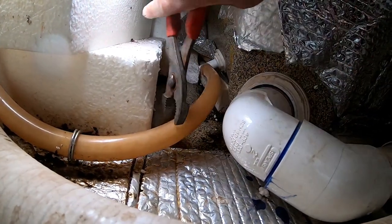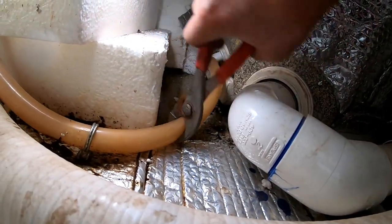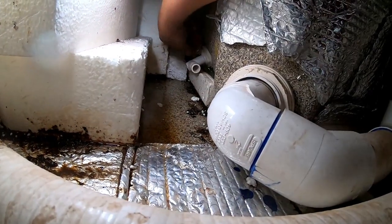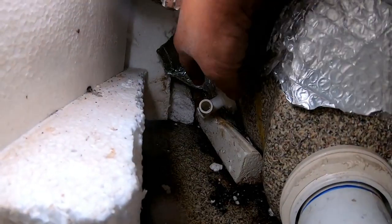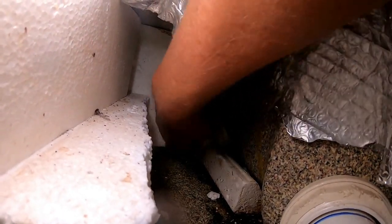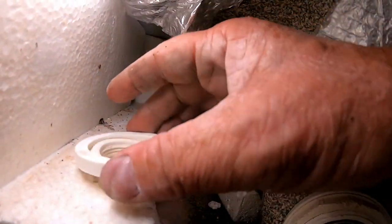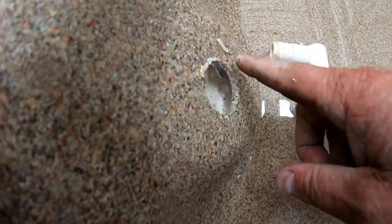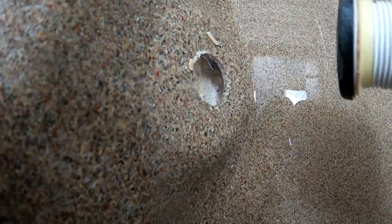I've got all the water out of this tube and heated it up. Now I take a pair of pliers and start twisting it over here — that'll break the seal down by the jet, and then it just comes right out without breaking anything. Do the same thing with the other one and pull that jet out. Look how much it moves. Unscrew it, take it out. There's the retaining ring and a collar that sits against the tub. You can see where everything got crusty — the o-ring is just junk. I might need to put a new o-ring in there.